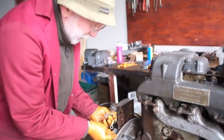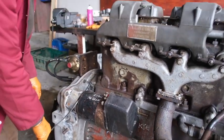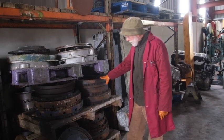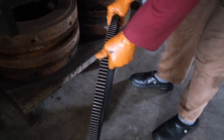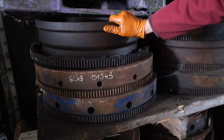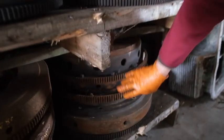Here you can see the wiring that would come across from the wiring loom, and normally they would go on there like that. That becomes live once you turn the key, energizes the coil, and energizes the starter as explained before. Here you'll see a wide variety of flywheels used on Gardners and their associated ring gears. This is the bolt-on ring gear I mentioned; this is a particularly light flywheel that came off a bus. These would be heavy marine flywheels here, and that's a flywheel used in conjunction with a torque converter. They all have this starter ring gear on them — some bolt-on, some sweat-on.